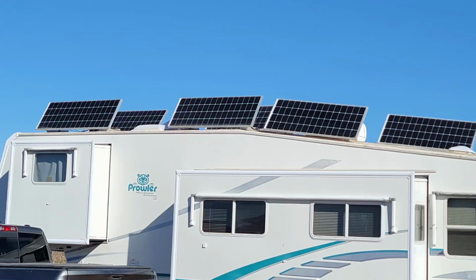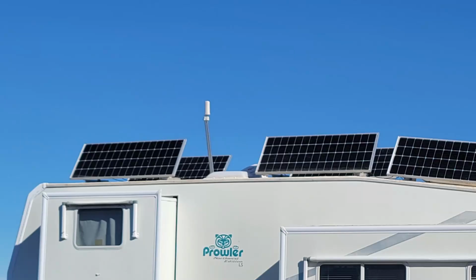So anyways, if you're trying to optimize your solar, always make sure that all of it's in direct sun as much as possible. As you see, ours were tilted to be optimized. Beautiful day, clear. We're in a position where there's nothing else around us that's going to cause shadow effects. Just that antenna there was dropping us just over 118 watts per hour, and that's just when I took the sample right now.